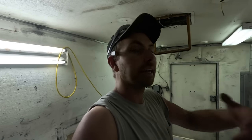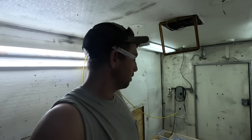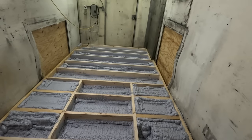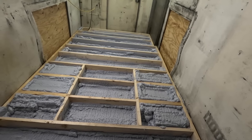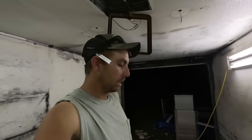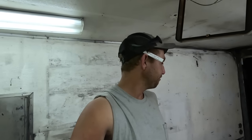Re-skinning is going to be a little work, but I want to get that done before I frame these walls up — the walls won't take much to frame out, they'll go really quick. Gotta get the floor in so I can get the big garage box in here. It's all coming together. By the time I throw the R19 in here, I should have around R30 to R32 in this floor, which is going to be nice. And by doing spray foam I don't have to worry about a vapor barrier either.